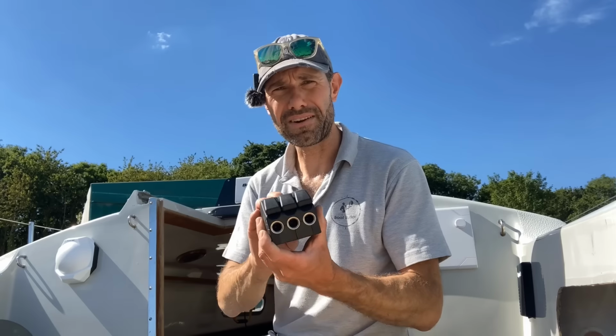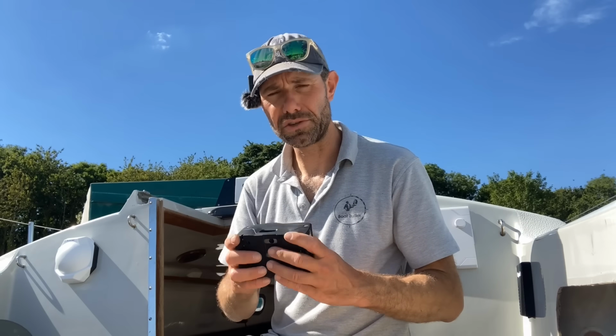So apparently these things are slightly kinder to the ropes because of the way they hold the rope when it's all under load. Up on deck, if you saw the earlier videos, you may have seen that I fitted a Selden deck ring to go with the new Selden mast, but I also need some deck organisers, and I apologise for the noise. This is a working boatyard here and they're moving cradles around. So I'm going to be fitting some Spinlock T38 six sheave deck organisers. They are a great fit for these boats because they bend slightly, so they will take on the curve of the coach roof, which is slightly rounded, so I tend to fit them and nothing else.